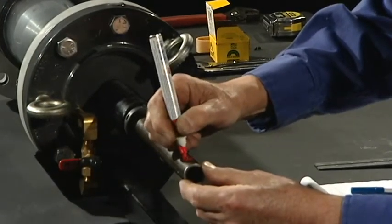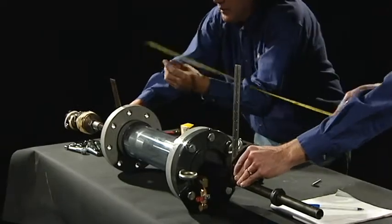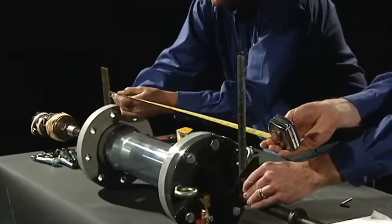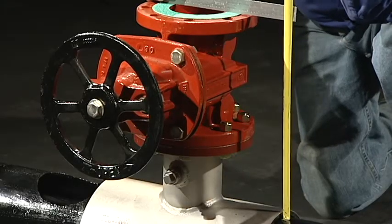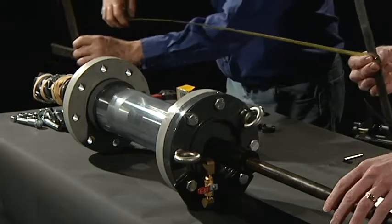Attach the plug to the inflation ram, making sure the orientation of the plug is marked on the upper end of the inflation ram. Next, measure and mark the distance that the inflation ram must be pushed into the launch cylinder to position the plug's outer diameter at the pipeline ID. This distance includes all components from the pipeline ID to the inflation ram plug position lock collar.